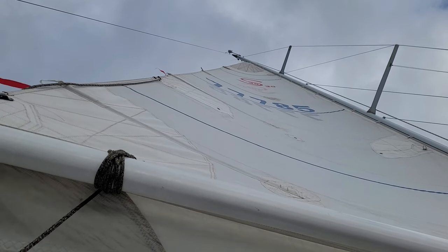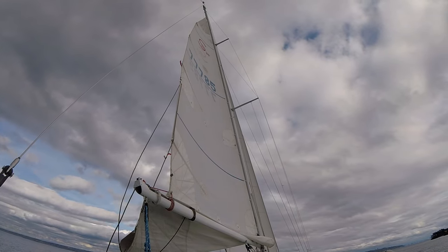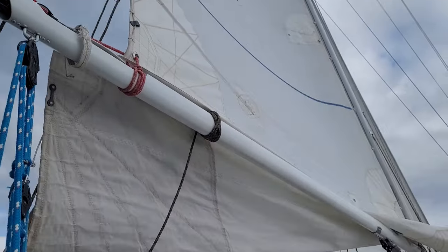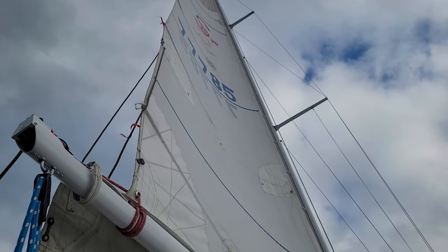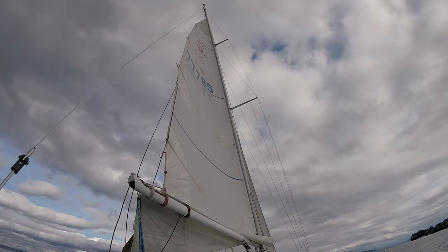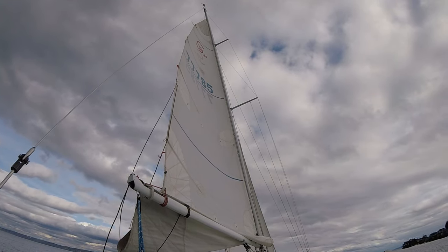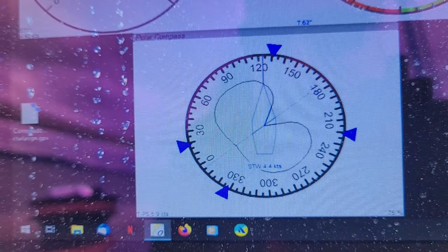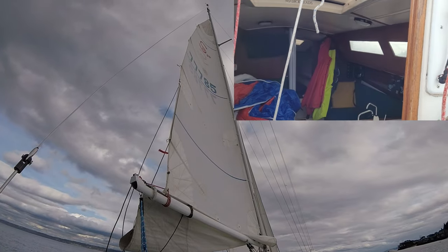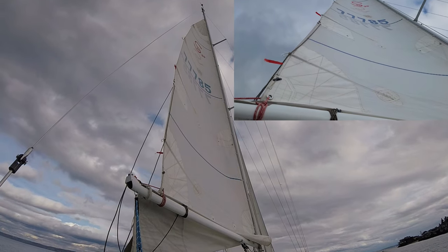Okay. So remember, I put the backstay on tight. It's on the max. Okay, so let me let this out a little bit. Let the backstay out. Okay, it's still pretty flat. Say we're still going pretty slow here. So our polar speeds, we've lost speed: 70%, 77, 75. So we're nearly a full 10% slower. Okay. And I could power up more.